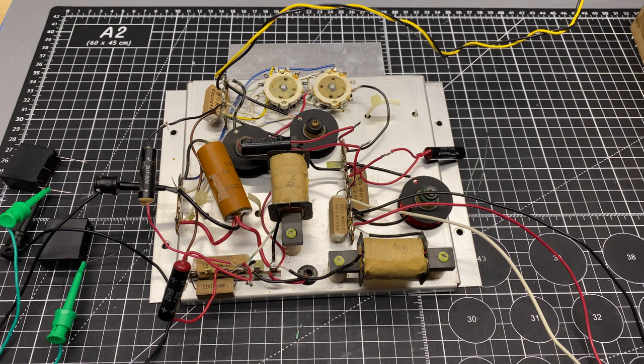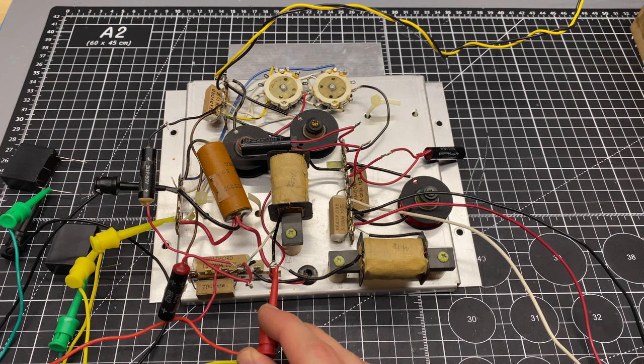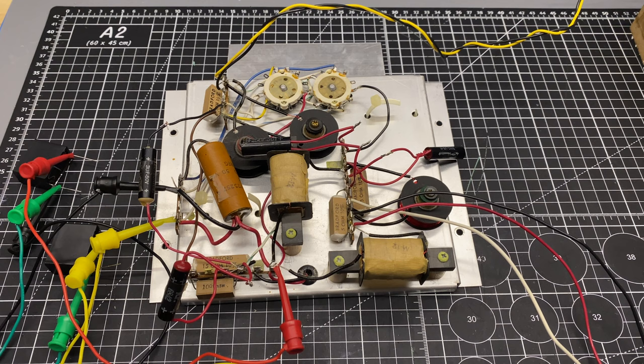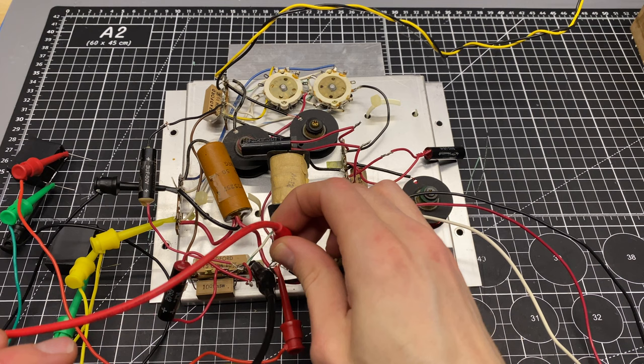So I've got this one here. So that replaces one section, and the other comes down here to replace this one. Okay, so that's the substitution. And now let's connect the amplifier again. Amplifier, and instead of going to the crossover plate, I know that those terminals come right to these two points here, so I'm just going to connect right on the crossover board here.